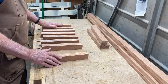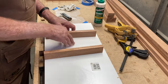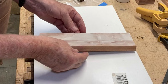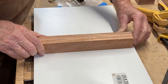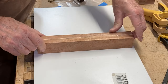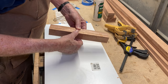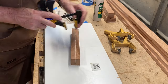My next step is to glue all of these parts together for the legs. I like to use a piece of melamine to do this so I can wipe the glue up real easily. It doesn't take a lot of glue. Now, just take the two pieces, slip them together, and rub them back and forth. This is a rub joint, and it just compresses all that glue in there and creates a vacuum — it actually sucks itself together. I can't even pull those apart, though I could slide them apart. So once they're like that, I'll just put on the clamps.